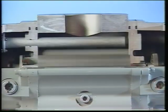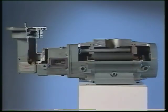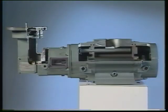While Roots rotary meters are designed to let fine materials in the gas stream pass through, it's important to prevent trash from entering the meter. Very small particles and viscous materials, such as lubricants and sludge, can interfere with the clearances between moving parts. This can prevent the impellers from spinning freely.